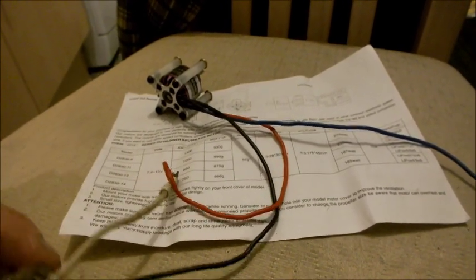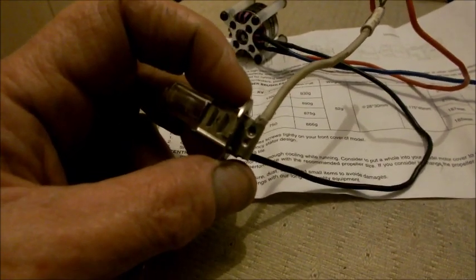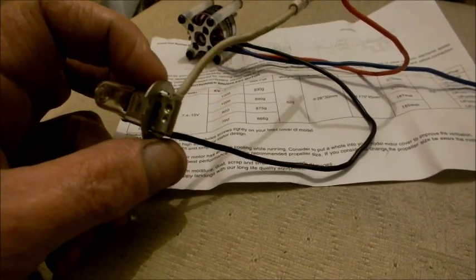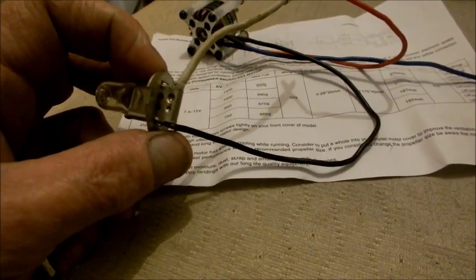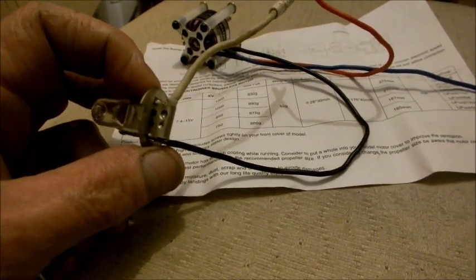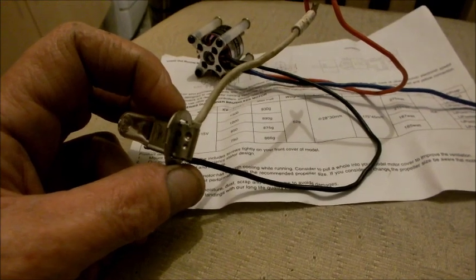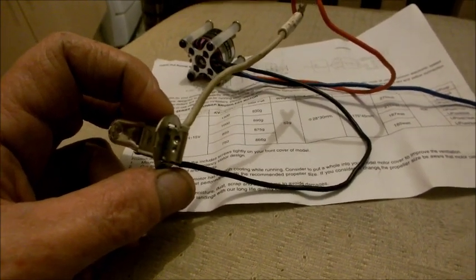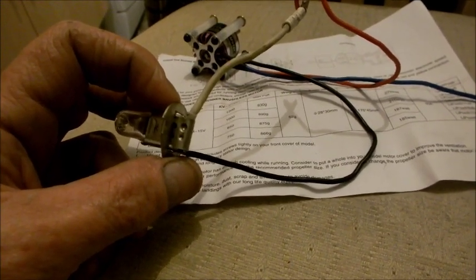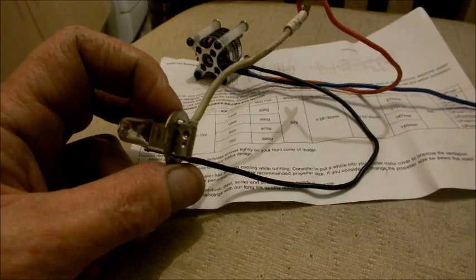In this experiment using a standard spotlight bulb, this draws 4.5 amps. So with three bulbs you are looking at a power delivery of around 13.5 amps. Feeling the motor after it was run for 10 minutes it was quite cool, so I would expect that this motor would actually deliver considerably more than demonstrated here.